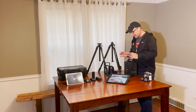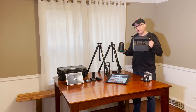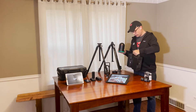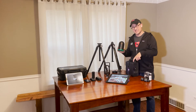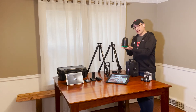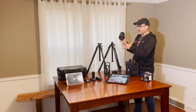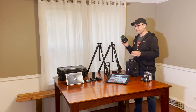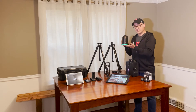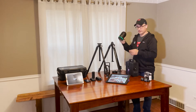What I'm showing here is a Pro 2 device next to a BLK360 — the size is different. The Pro 2 is a larger device with a different type of sensor: infrared structured light. The Pro 2 is not a laser. This Leica BLK360 is a LiDAR laser — a real laser device. Leica provides their own tripod, but I choose not to use it because of its, in my opinion, inferior quality. This device is $18,500, and I think the tripod Leica provides is ill-suited for such an expense.